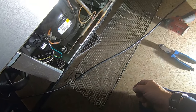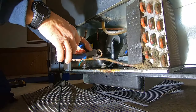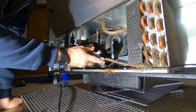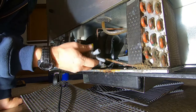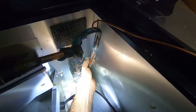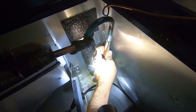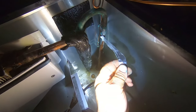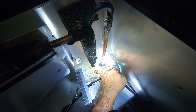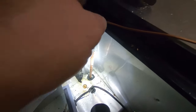I'm going to go ahead and bend this up so we can get the new dryer in line without any major problems. It's going to mount up right in there like that. You don't want to open this until it's time to braze it in. The thing I've noticed is that aluminum they're putting on there is a dissimilar metal—it has a tendency to corrode on the copper. So it's great that the conductivity value is there, but honestly I'm not too impressed with the way it turns out.